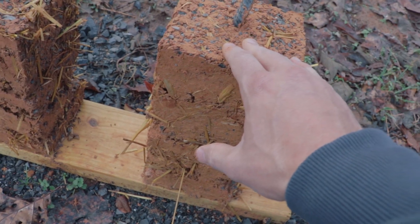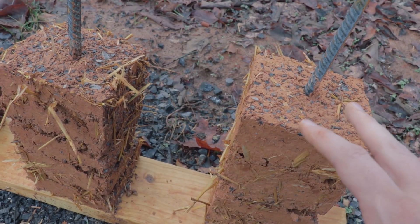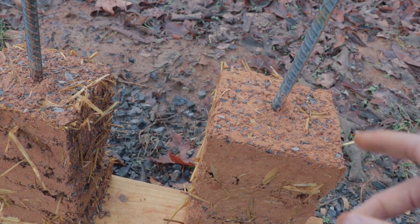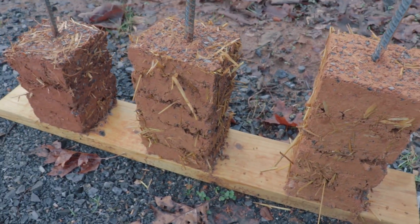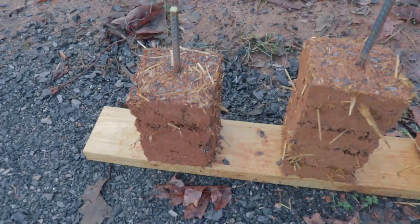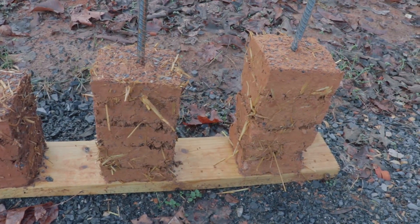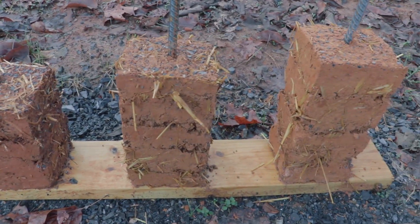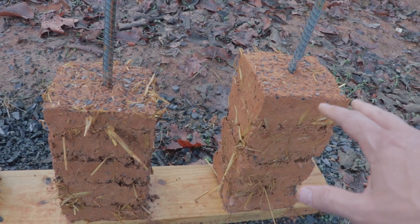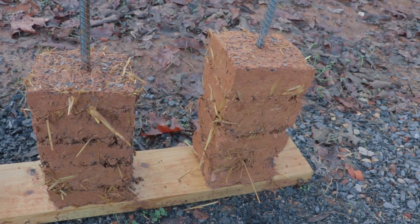I'm pretty favorable to this 10% mix. In the future I might do a comparison between a 10% mix of just lime and a 10% mix consisting of 5% lime and 5% pozzolan. But anyway, I think this was a good experiment — it's pretty clear to see that stabilization makes the cob stronger and more water-resilient. As these blocks dry out over the next couple of days, they're going to be solid again, even this one, and especially these two — they're going to be rock solid. The stabilization protects the cob from moisture.